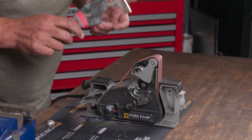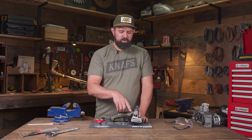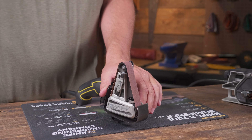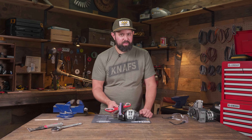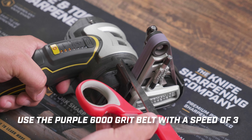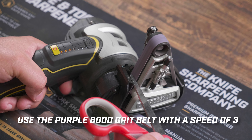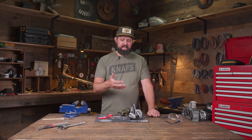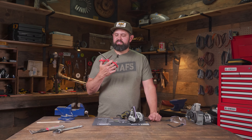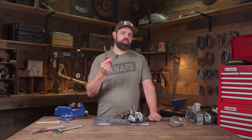Let's sharpen some scissors. Scissors are pretty straightforward — there's actually a scissor guide on the Ken Onion Mark II located right here. You remove your original guide and this is the guide for scissors. Scissors only have one bevel, so you're going to lay the scissor flat on the guide in contact with the belt, power the machine on, and pull the scissors across the belt using gentle pressure all the way to the tip. I don't recommend jumping over to the blade grinding attachment — this guide makes it so simple it's the easiest way to put an edge back on scissors. Just like the shears, scissors are actually self-honing, so after you've put an edge on them give them a few snips to hone them and you're good to go.